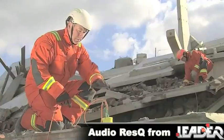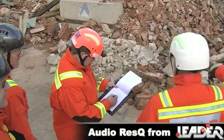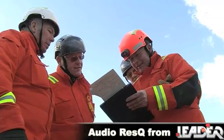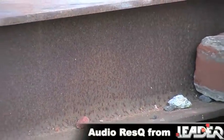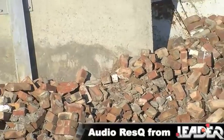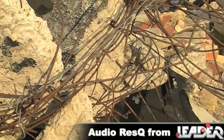Let's look at the unit's applications and deployment. Understanding these is crucial to maximise the system's full potential. Once the search area has been determined, you will need to map out this area. Good planning at this stage will optimise the whole search procedure. It is important to recognise that any collapsed structure can be made up of many different materials and that, where possible, it is important to locate the sensors on similar materials. This will give far greater accuracy in determining the victim's location.